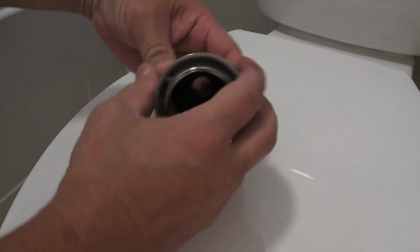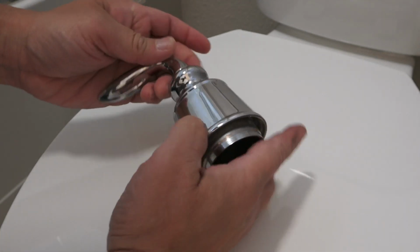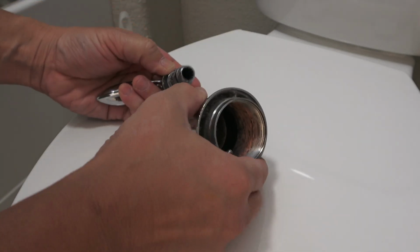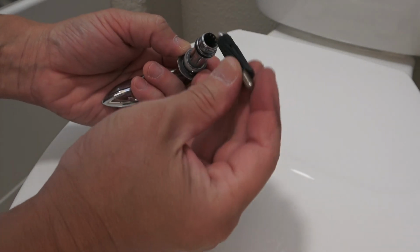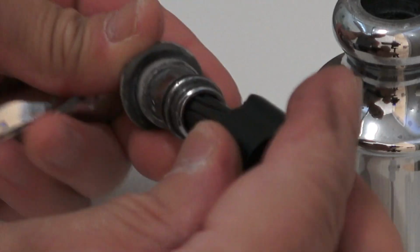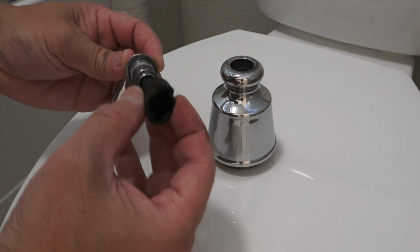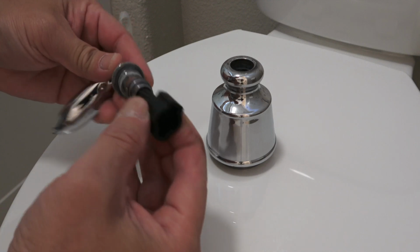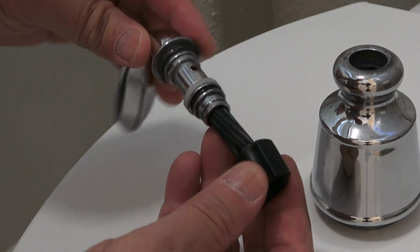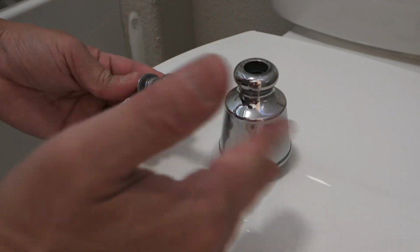Okay, let's take a closer look at the handle here. It actually came loose. So this is actually good, so I can show you what's going on inside. So basically the handle part, it goes in like that. And then it is connected to, let's take this out. Inside here, it is connected to this rod here, if you can see. And it fits like that, and it is connected to this piece here, where then when you move the shower handle, when you crank it to on position, the whole piece here also moves along and it opens the shaft to turn it off and on. Since this is broken apart, it doesn't have any impact when you turn the handle. So that's a problem. So what you need to do right now is to get a new replacement shower handle.